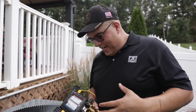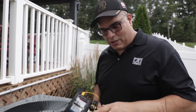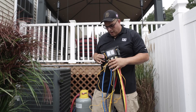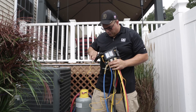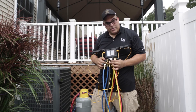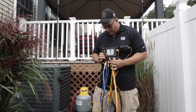So we're wrapping up the day now. This unit is running flawlessly with a great temperature difference across the coil. We're going to take these gauges off right now so I can show you how to put them away in the case. The nice thing about these manifold digital gauges is you can move the temperature probes out of the way so you can work with your hand valves when charging, evacuating, or recovering. These go nicely out of the way.